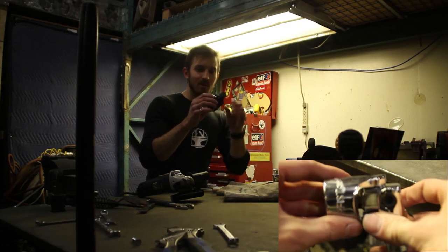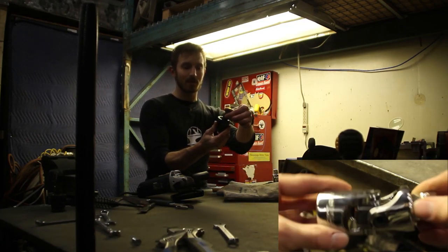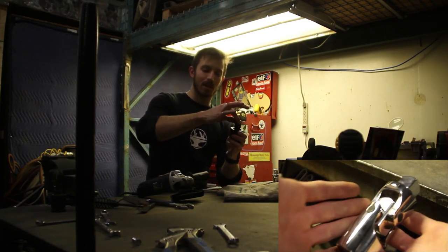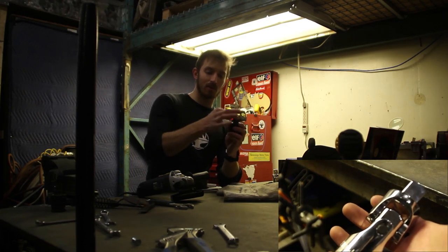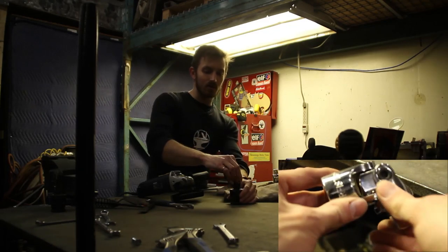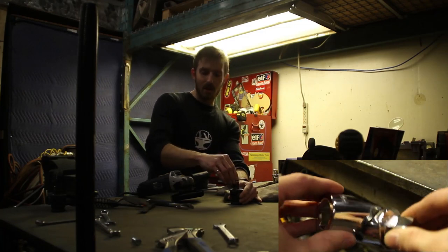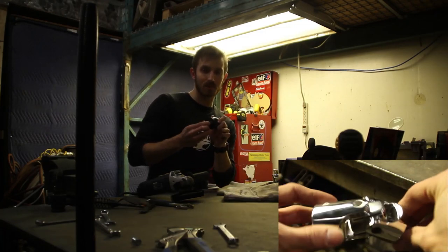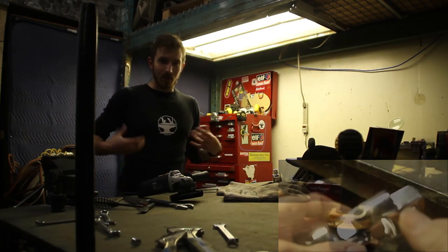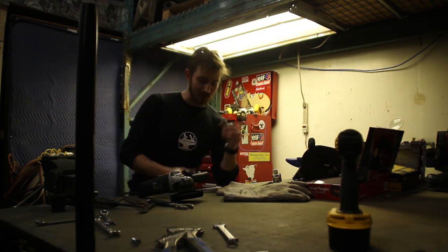This is also called a universal adapter, but it's basically a giant ball joint — it can't spin, but it can give you a bit of flex in all directions. I'm planning on using these for the legs: one for the ankle, to give your leg ankle mobility, and two for the hips, so when you're running around the exoskeleton can move with your body without being a rigid box that you're stuck in, like the original exoskeleton.